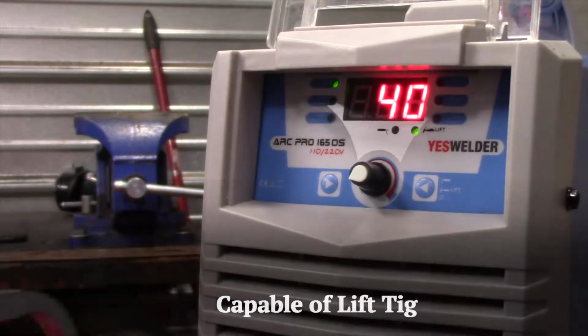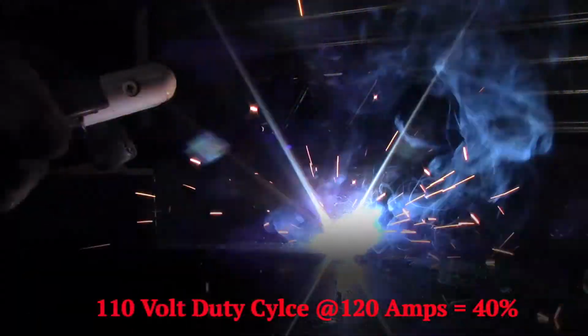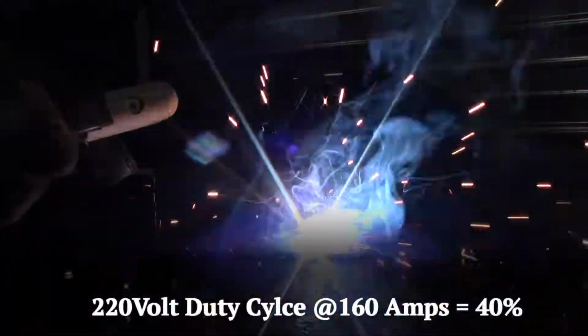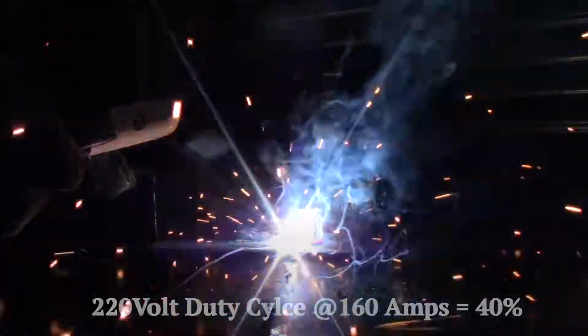You can easily weld with this machine off of 110 volt or 220 volt power. The rated duty cycle for 110 volts at 120 amps is 40%, and the duty cycle for 220 volts at 160 amps is also 40%.